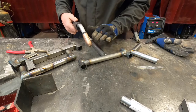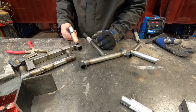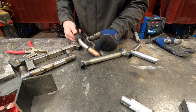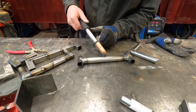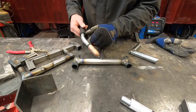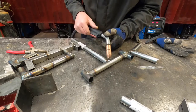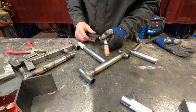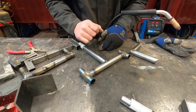When you do your round tube welds, I would recommend actually welding downhill. Typically welding downhill is not as strong as welding uphill, but on this thin wall tubing with the welder set up right, welding downhill will definitely have enough heat to fuse these pieces together. On our T joint, I'm going to start on top of the tack and weld down as low as I can reach, then flip it and do the alternating side — start on my tack, weld down as far as I can reach, turn it over and repeat. If you always weld as far as you can reach, your welds are always going to overlap each other. That's the technique — overlapping our welds so we don't leave any spots unwelded.